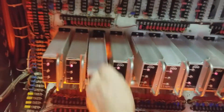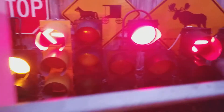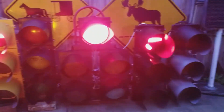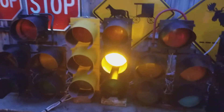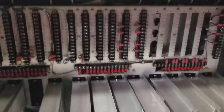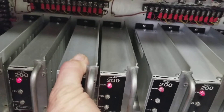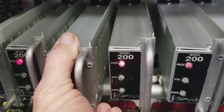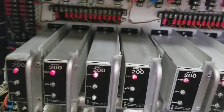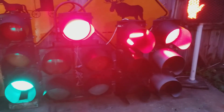If I have a failure — say, one of my load switches fails — it puts the whole system into flash mode, as you can see there. That tells me there was a failure. The malfunction management unit tells me something is wrong with channel three, which is load switch one, two, three — and it's missing. So if we put the switch back in and reset our MMU, all should be right with the world — and it is. Everything's working normally again. That's how the MMU works.